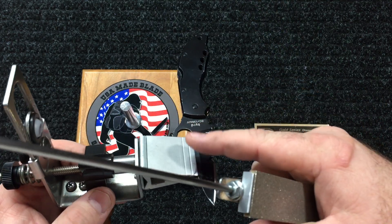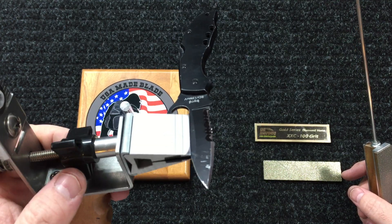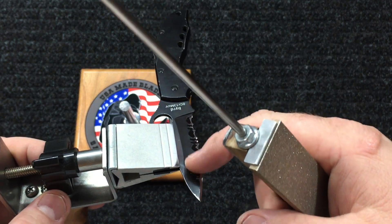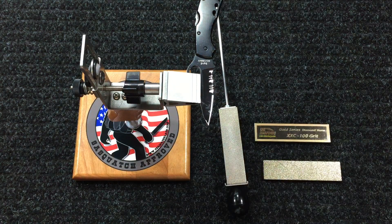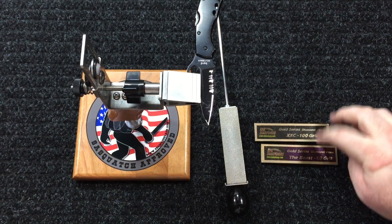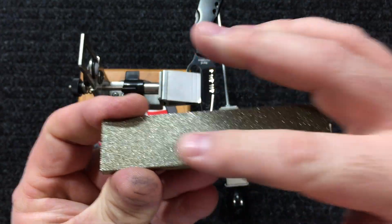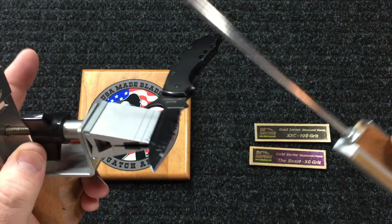That's why if you're going to use water or oil, especially with a new stone, you just about need to wipe it after every pass or two to clear any slurry mixed with loose particles. With your 300, 600, or 1500 grit stones they're so small you're not going to have that problem, but the bigger coarser new ones are going to shed particles and end up scratching your blade. I'm not telling you what to do — you can use oil or water, do whatever you want — but I do it dry and I get great results. If you choose to use oil or water and you've got new 50, 100, or 140 grit stones, you better wipe very often or you're going to get scratches until those stones are well worn in.